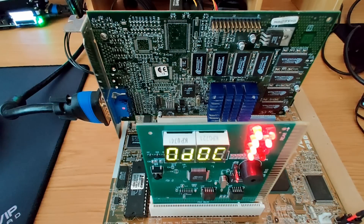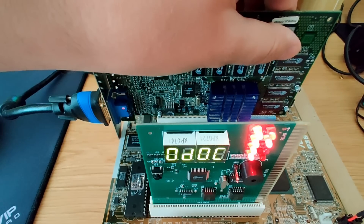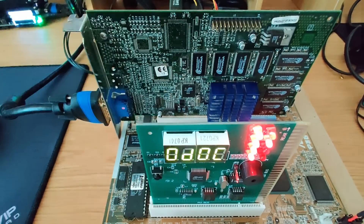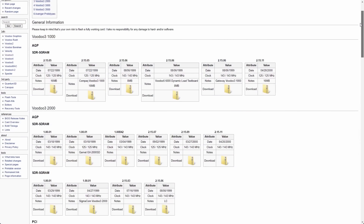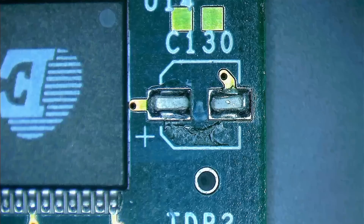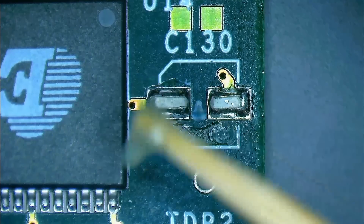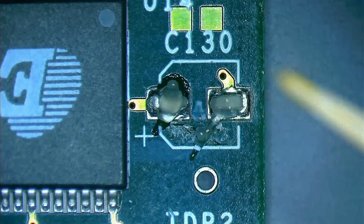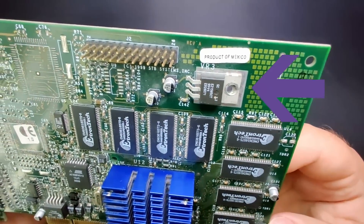Similarly to the Synergy 2 and the Geforce 2MX I suspect a corrupted VGA BIOS. However, every case is different and this time it is a 3dfx card while the other two were Nvidia cards. We will use new tools to flash the BIOS, compare the corrupted BIOS with a working file downloaded from the web, and add components that are currently missing — specifically the capacitor that has been knocked off next to the memory, as well as the heatsink for the voltage regulator.